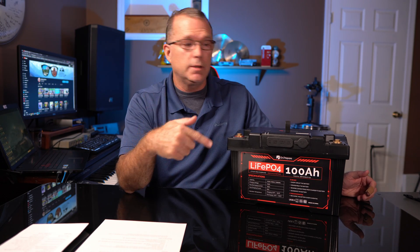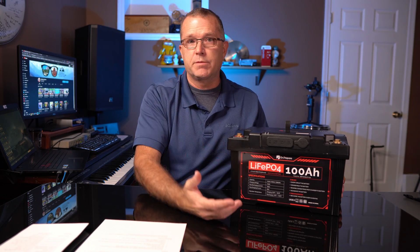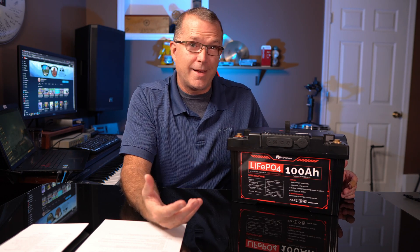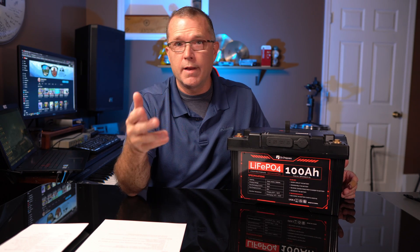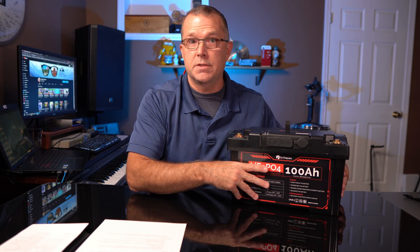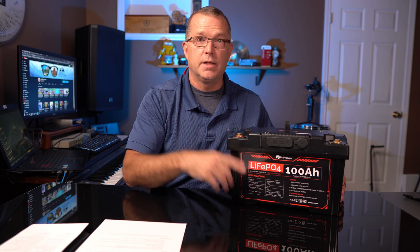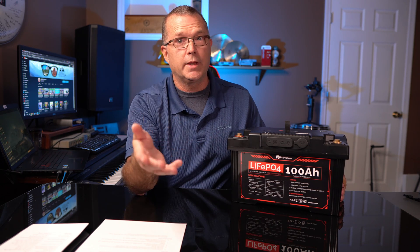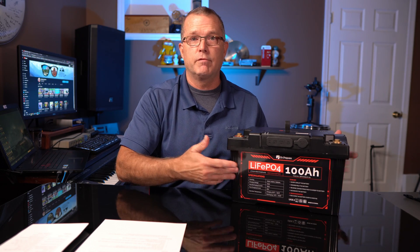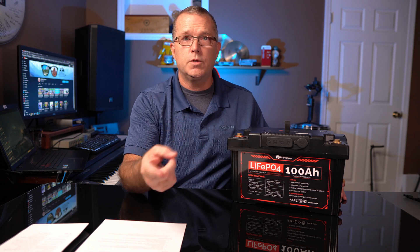As you saw in the clip, you can directly connect a 100 watt solar panel to the front of this and charge it. Since it is limited to a 100 watt panel, just be aware that a typical 100 watt panel is not going to produce more than around 500 to 600 watt hours in a day. And that is not enough to top this thing off from fully depleted to fully charged in a single day — it's more like a full two days of charging without any discharging.